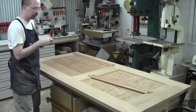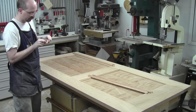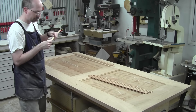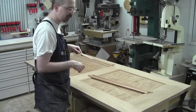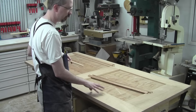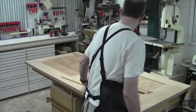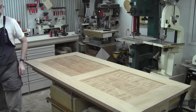I'm going to pull out my scroll saw and see if I can cut this out and then file or sand it to get close. I'm goofing around to see what I can and cannot get away with. I have enough extra that I'm not too worried about experimenting. I'm going to tear this down, pull out the scroll saw, and see how the cope works — whether I can cope with this. Hardy, hardy, hard. Okay, I've got the scroll saw out. The saw might be a tiny bit loud, so I'm going to take very light nibbles following this contour.